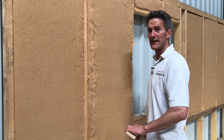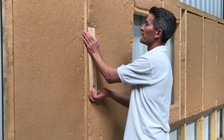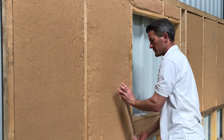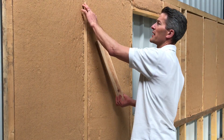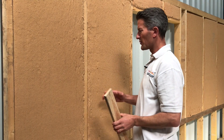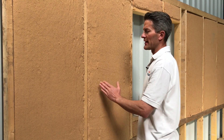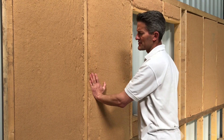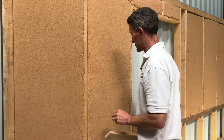If you want to really neatly finish it, do it with a bit of wood. You can just press it in all the way around. Try not to leave too much on top of the actual stud, because that will stop you getting your boards tight up against it. The reason I'm doing it with a bit of wood is because it gives a nice flat finish. If you do it with your hand, what tends to happen is you end up with a dent around the edges, which allows airflow to move through, reducing your efficiency.